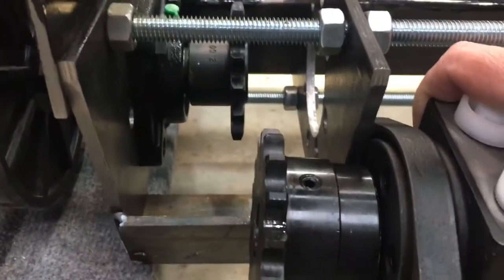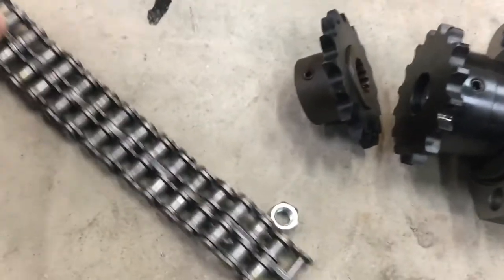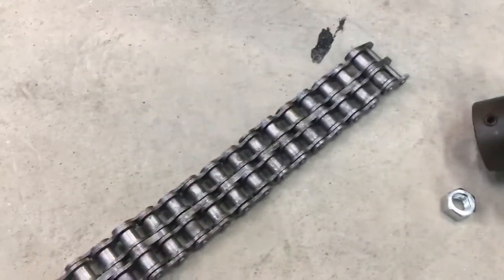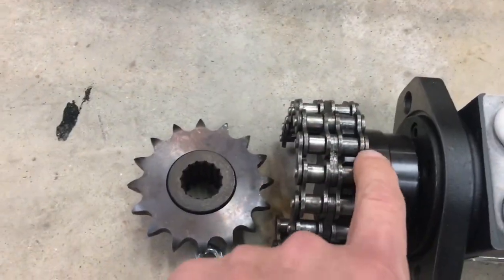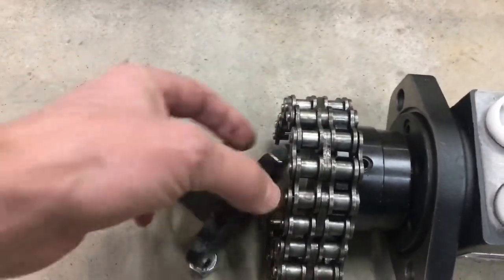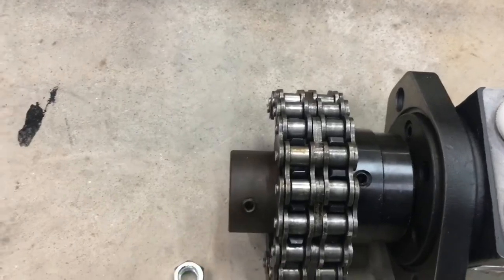On the output shaft of the hydraulic motor, there will be another hub and sprocket combination that will fit on there. So when this motor gets mounted in there, there will be two sprockets facing each other. They'll have about a quarter inch gap between them, and the means for connecting those two will be this section of double roller chain. So this will be the flexible coupling that connects the two sprockets together. Each link is fixed all the way through, so it uses a really long link, and both of these will get coupled together — that will be the means for power transmission.